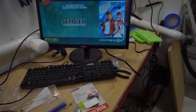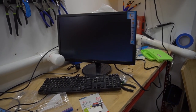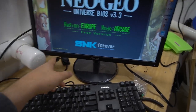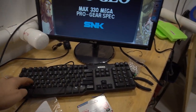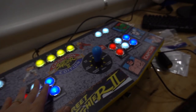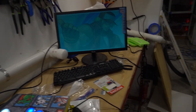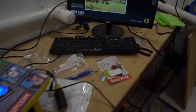He's kind of upset that some of the games are stretched - they are stretched to full screen. I can't do anything. He's got F5 set to coin. It's mind boggling. Mode exit, I'm not a fan. Now we got to get through this slow fade out. I wanted to do this as one solid video, but this is going to have to be a part two because I'm waiting for my SD card. This SD card doesn't boot - I'm going to reflash the image. The SD card he gave me doesn't boot and it is U1; I usually need U3.